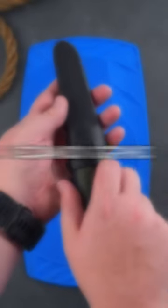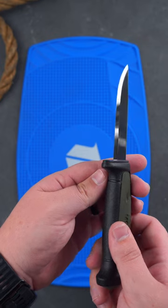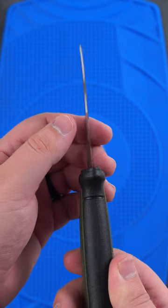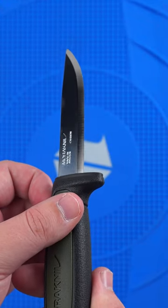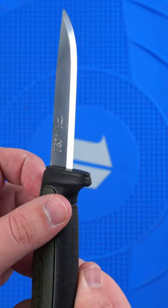The Scandi grind. Instead of a taper and a thin edge like the others, the Scandi is just an edge ground straight onto the stock of the blade. They cut very well, making them popular for bushcraft knives, but especially for replaceable razor and scalpel blades.